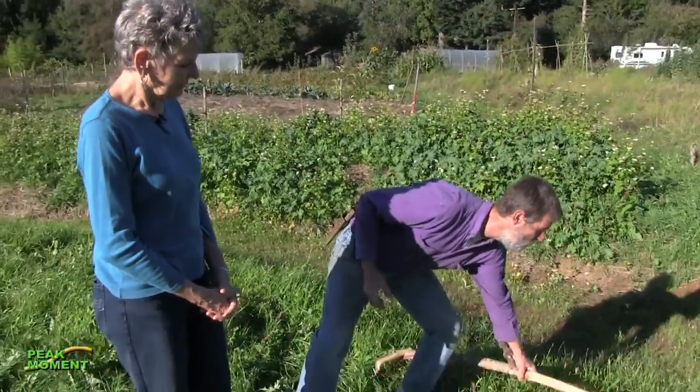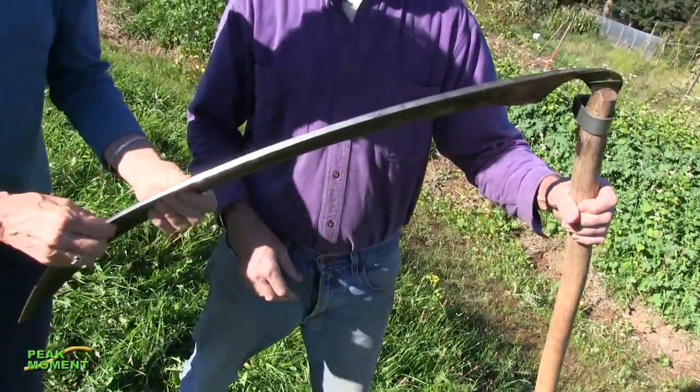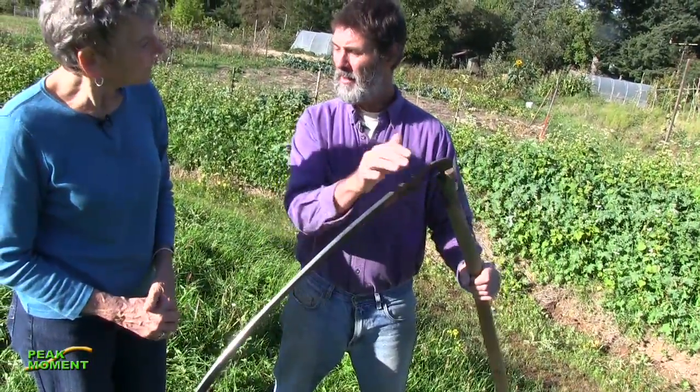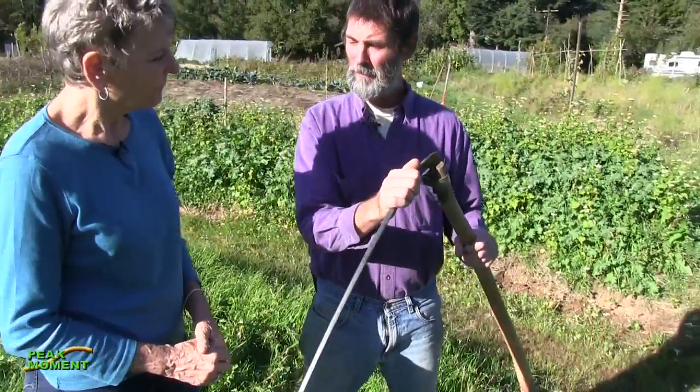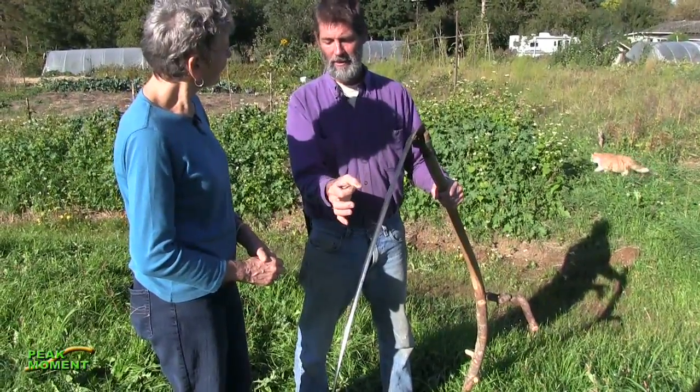The blade I brought up to demonstrate with — this is my open field grass blade. It's very lightweight, very long. This is not a blade I would use if I had rough material, little saplings, or blackberries. I have different blades for different circumstances. I have a very coarse, tough blade for brush — with that same blade I can cut down inch-and-a-half saplings. And a medium sized field blade for unproven ground where there might be sticks, stones, or mole holes. But this is for an area I mow frequently with no obstacles, and I can cover a lot of ground in a short period of time.